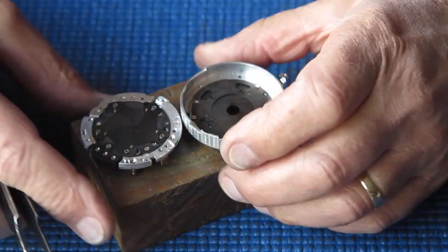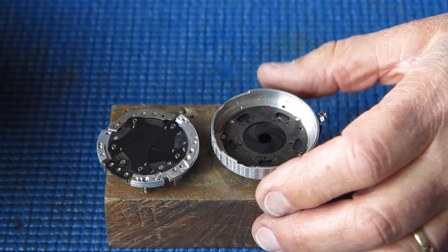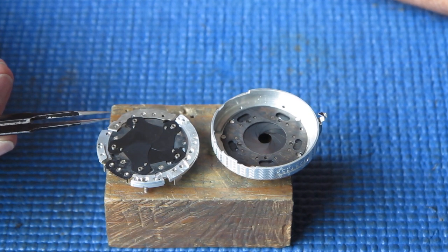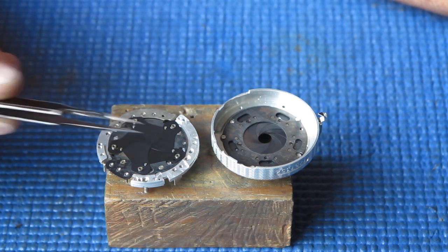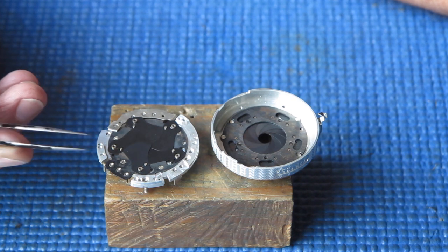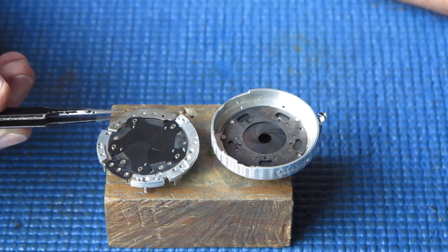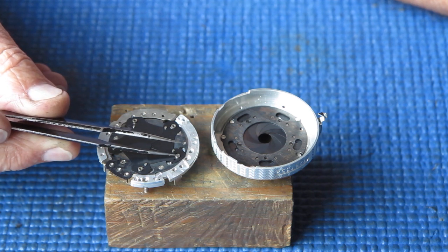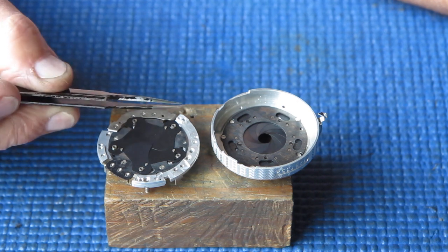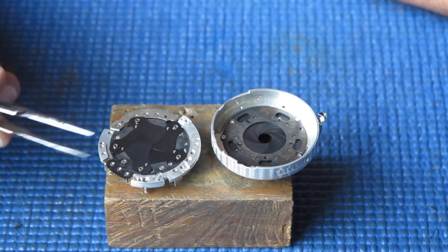Having a quick look at the mechanism plate, I'm looking to see if the blades have been put in correctly. This is blade number one — it's always in that position. Blade number one has an extra hole; the extra hole only helps to identify the blade, the blades are otherwise identical. It's almost a feature without any practical use. Blade number one is always here, opposite that particular rivet, about a quarter of a turn from the end of this retard gear train. Nothing remarkable — that all looks fairly normal.